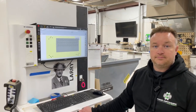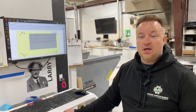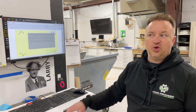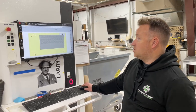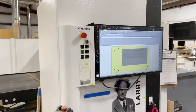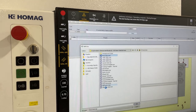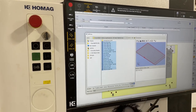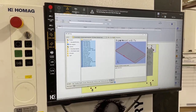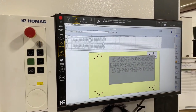The critique here: do you guys manually load everything? Usually if we're doing production runs, we set them in what's called a production list. I can hit F11, then quickly select all of these programs — some are kind of big so it might take a second — and now it's created a list and it'll just run from top to bottom.